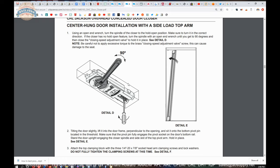Pivots are listed here as well and have everything to do with the bottom rail type and the application — floor mounted or threshold mounted. You can see what a typical opening will look like. The slide track independently hung offset arm installation is covered, as is the center hung top pivot installation, and that exhausts these installation instructions.